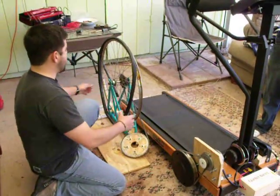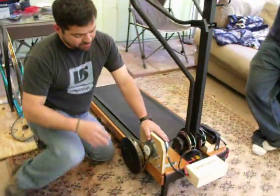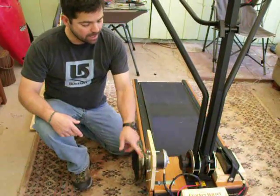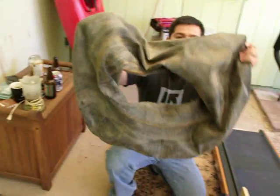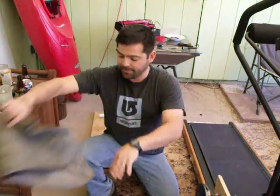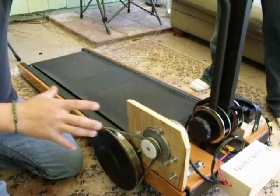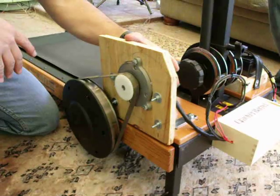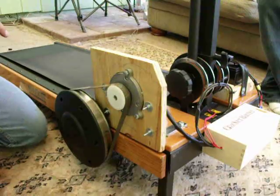So instead we backed away from using the power sled and jumped on this system, which is a direct drive — hooking up the pulley for the generator to our wheel. We used an old truck tire tube, and that's this right here. We basically cut strips out of it cross-sectionally and made a bunch of belts. We have a bunch of spares for this. Finding the right distance away from it was an issue, and locating all the components and making sure it was in line was another issue.